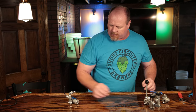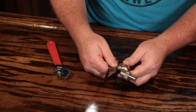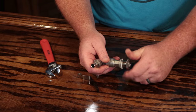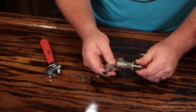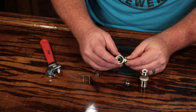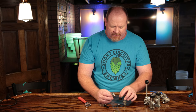Now let's take a look at cleaning. I've pre-loosened a lot of these so I can do them by hand. The first thing you're going to do on one of these type of valves is take the handle off — make sure you do it over a surface so you don't lose anything. Then the O-rings come out, and the body unscrews. Be kind of careful when you unscrew it because — yeah, see — there's liquid in there. There's a Teflon surface that the ball rotates on, a silicone seal, and then the ball comes out of the inside. Even though this thing has been dry for a while, when I took it all apart, there was water inside.